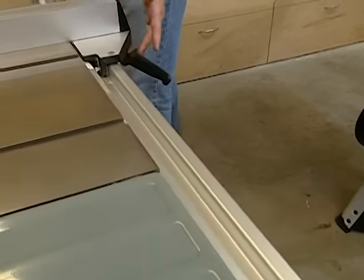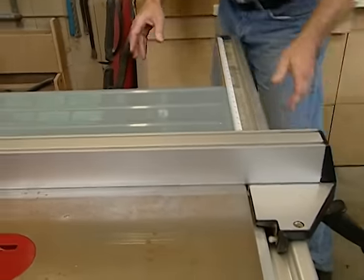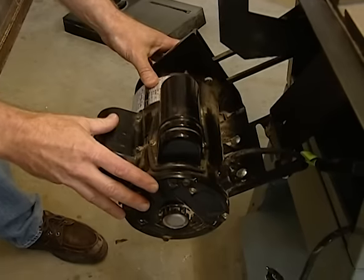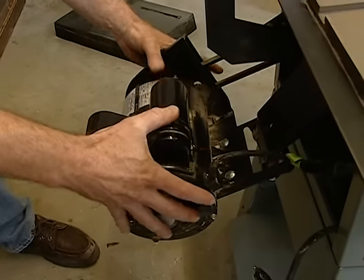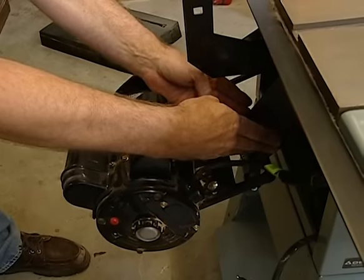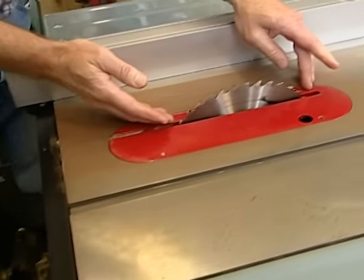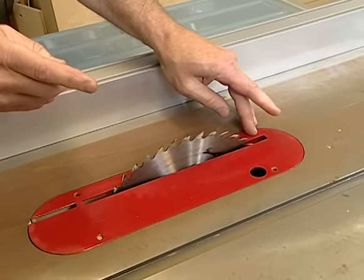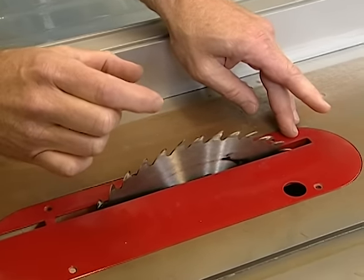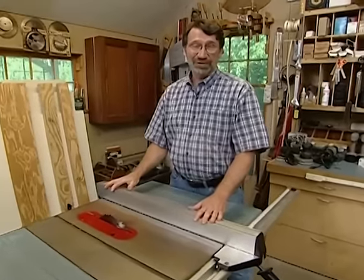The fence rail is aluminum, for weight, as well as the fence itself, which is dramatically improved over the bench top. We have a little more power here — it's one and a half horsepower, 120 volts — and this motor can be removed to take away weight if you want to move the saw. It unplugs and comes off the bracket easily. It's a V-drive single belt, not a direct drive. We have a 10-inch blade, and this one has an advantage over the bench top in that the arbor is long enough to accept a full-stack dado set. With a saw like this, you can begin to think about building some fine woodworking projects.